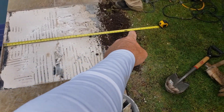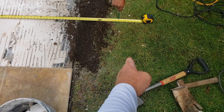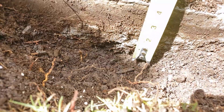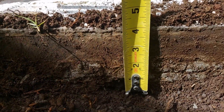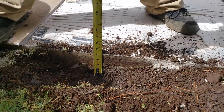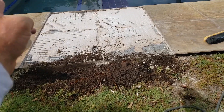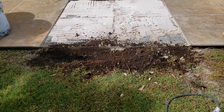From the edge of the concrete back four feet, it's going to be here, so we're going to cut out that area and pour it right there. This pre-existing slab is four inches, and we're gonna need to bust out the slab to get to a minimum six inches, but the manufacturer would like ten. All this area here comes out, and then we're going to extend it back so that we have, on center, a four-foot by four-foot slab ten inches thick with number five rebar.